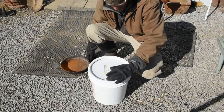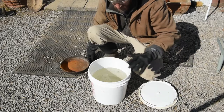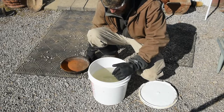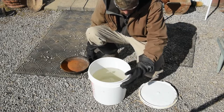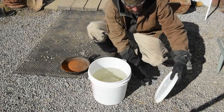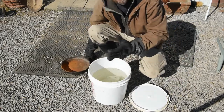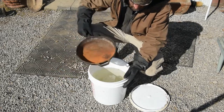What we have here is our bucket of lye — of course I have it marked 'lye' and 'poison' on it. If you don't have a bucket of lye already, you can make one up: put one pound of lye to five gallons of water. I leave it down a little bit so that when I put the pan in it doesn't overflow. You want to clearly mark your bucket and lid with a tight-fitting lid, because you don't want children or animals getting into this. But really it's fairly safe as long as you use the proper precautions.